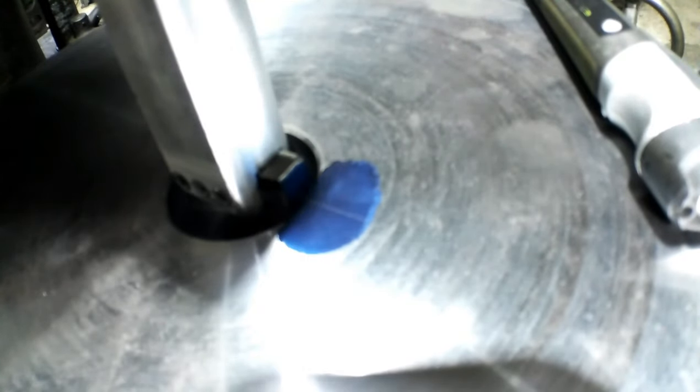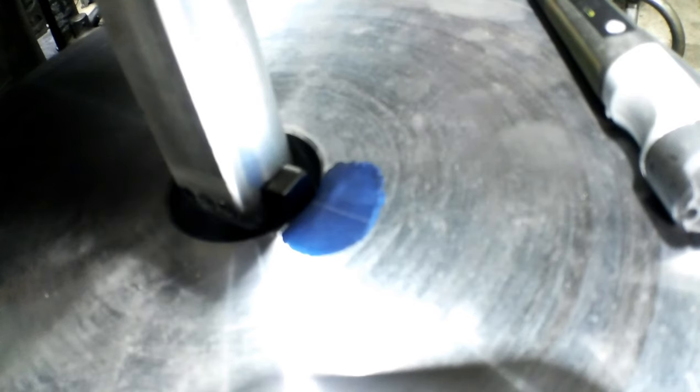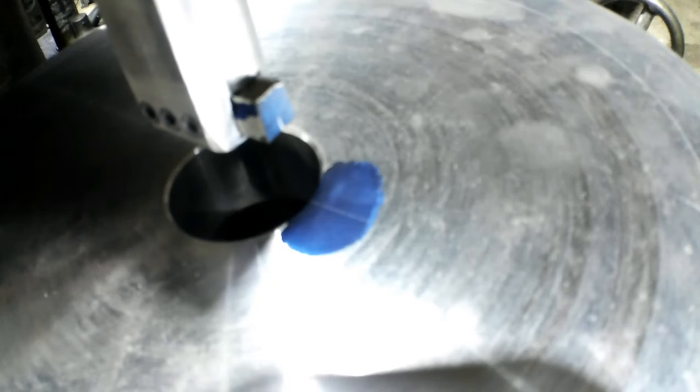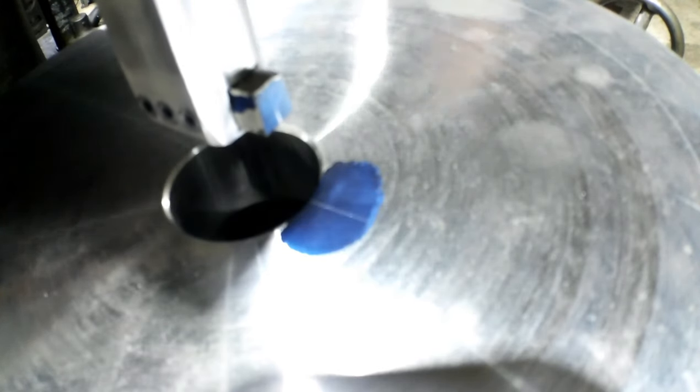But we don't know if we're centered. That's where I'm going to back my cutter up just a little, drop it in a little bit, and now bring it in just a touch on the corners, if I can see it. I think I'm there. We'll see if it scrapes on the corners. You do this all by hand. Then look in there. We didn't touch, so let's take it in another 5 and try that again. I'll just keep doing that until I hit it.